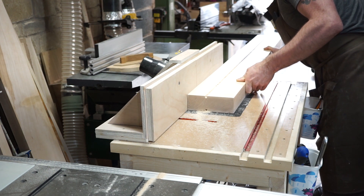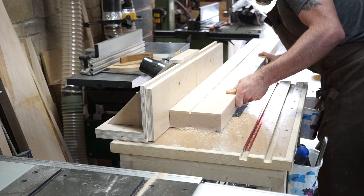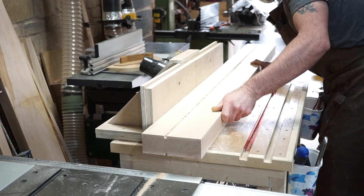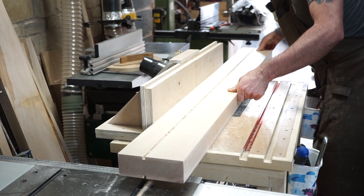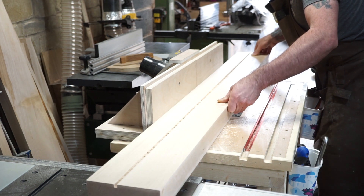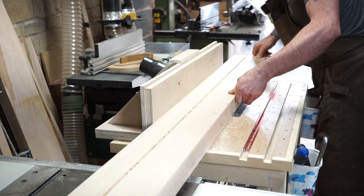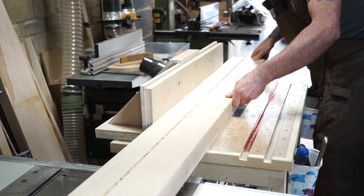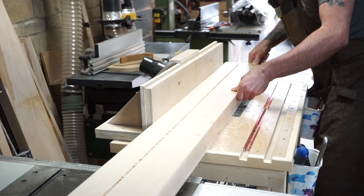Here I'm routing a groove into both sides of each of the bench top timbers. This is used to place a full-length batten during glue-up to help keep the boards as flat as possible, in order to reduce the amount of work needed to flatten it afterwards. I was debating whether or not to do this but I'm glad that I did. Whilst it didn't keep the glued top completely flat due to the router bit shearing and me having to finish the job with a plough plane, it did keep it to a variation of less than a millimetre across the width of a half bench top slab, which is pretty good at this scale.